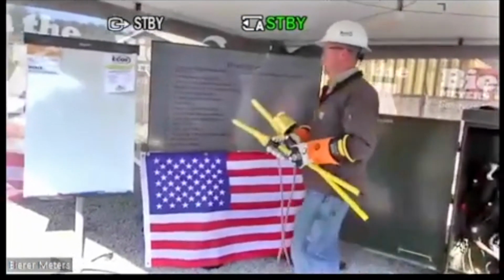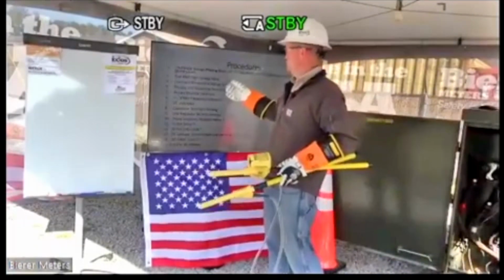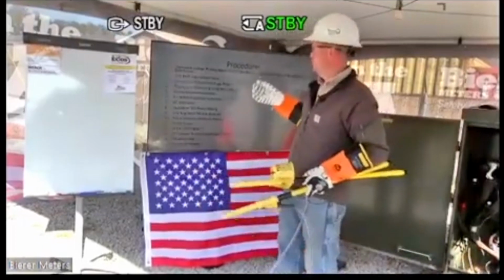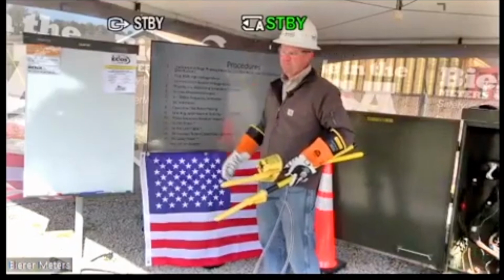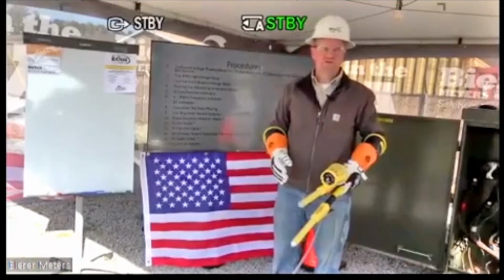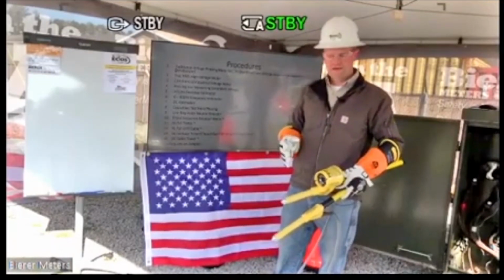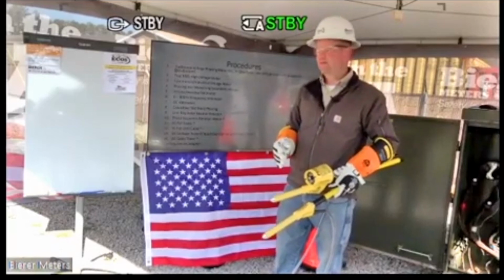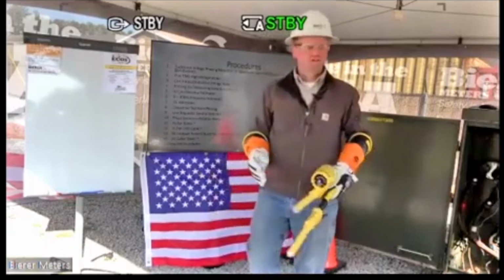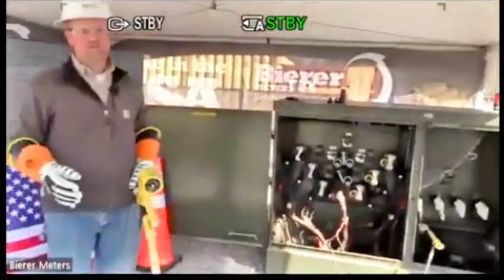And again, that's more of the same with number 3. If you look at the list, all your C&I voltages, that's essentially what they are, secondary voltages. So those two are basically going hand in hand along with number 2. Number 2, those are true RMS readings that we just took. The 121, the 211, 212, true RMS, extremely accurate within 1%. And the traditional phasing here would be your phase to ground and your phase to phase.